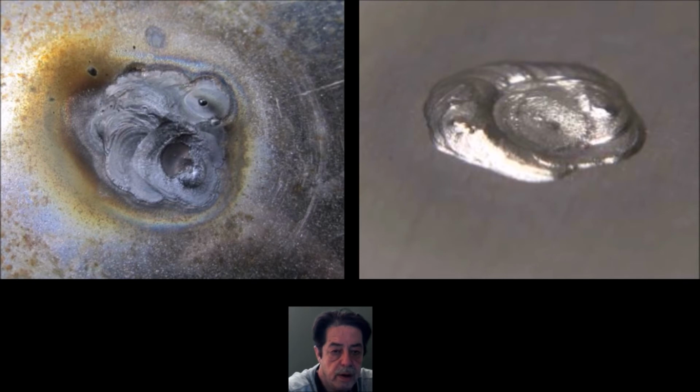Try it, hit the trigger. If you think it's burning too hot, or again, if it burns another hole, back off on that temperature. Then come back at it again, and you'll very quickly see you're able to hit there and flick that trigger, and it will start to make these little spot welds that I'm telling you. And then eventually you just blend them together by going right, left, up, down, like I was saying. So I hope that answers the question for you.